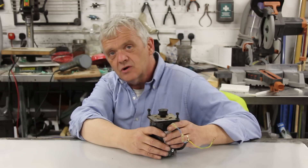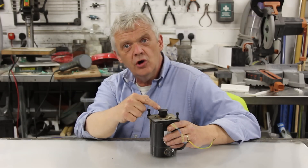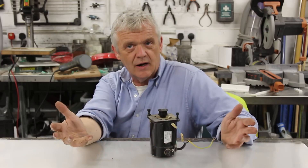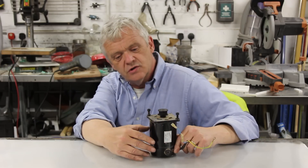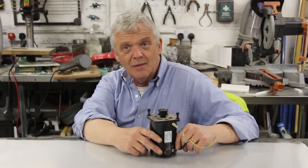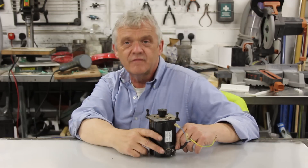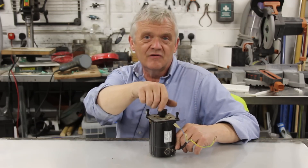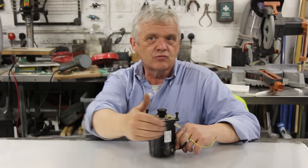Those physical limits matter when looking at it the opposite way, because in generator mode we're going to put a turning force on there and hope it generates. Now the question is how much will it generate? These things have a volt per revolution associated with them. This turns at 4000 RPM, meaning that for about every 17.4 RPM we get one volt out of it — every increase of 17.4 RPM increases output by a volt. So I can turn this by hand at around 80 RPM and get about five volts out of it, putting in a certain amount of torque to do that.